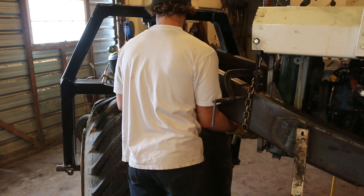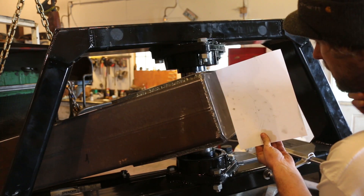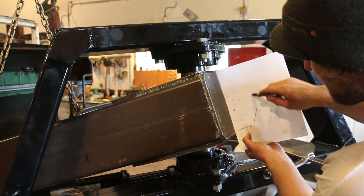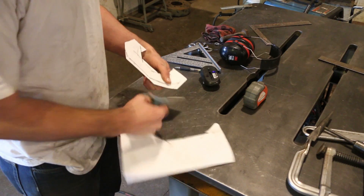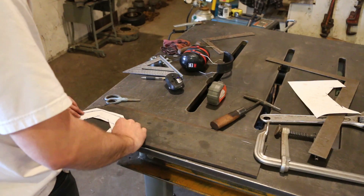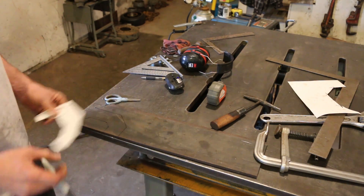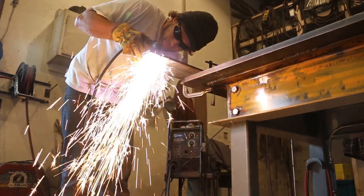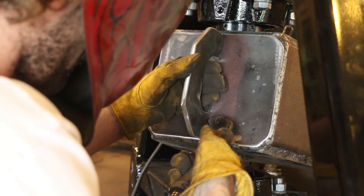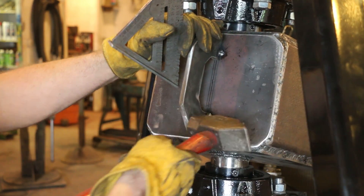I was having trouble figuring out how to pick the front end of the buggy up with the hoist without the chains being in the way of the fork — everywhere I grabbed seemed to be in the way. So I thought I'd take a second to make the tie-down on the front of the buggy. I needed to do this anyway, and if I got it done I could hook the chain around it and lift it up in a spot that would allow me to rotate the wheel to both sides without it hitting. After drawing the shape on cardstock I transferred it onto some flat bar, cut it out, and welded it on. We use these tie-downs to chain the buggy down to our flatbed trailer so we can haul it to different locations on the farm.